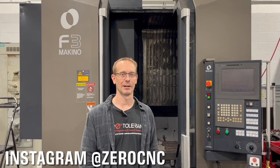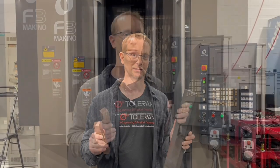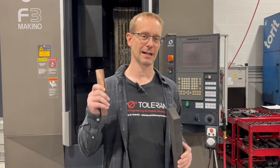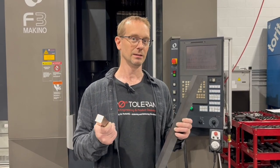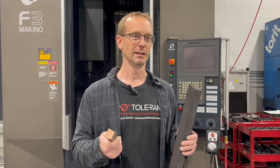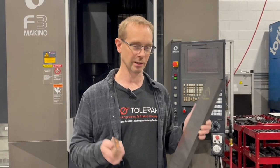Welcome back to Zero Tolerance for another episode of Learn to Burn with Practical Machinists. In today's episode we're going to talk about copper versus graphite — which one do you use and why? We're going to compare high-end graphite and high-end copper in this episode, specifically POCO 3. We don't use copper in our shop much at all — mostly for burning carbide — but in most cases we use graphite and a lot of it, so instead of three electrodes you might need ten.